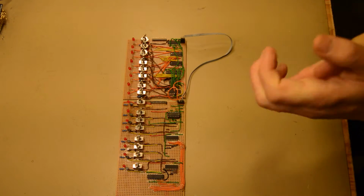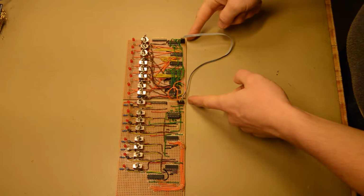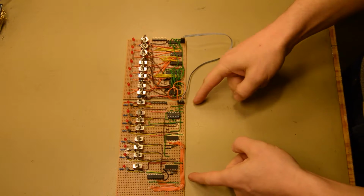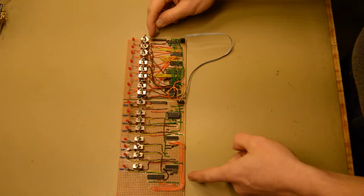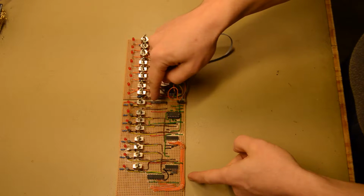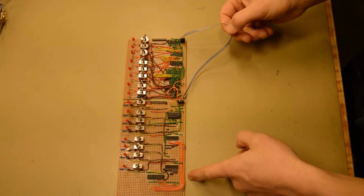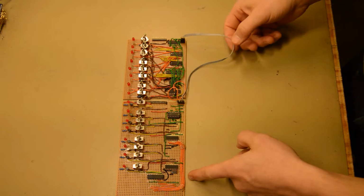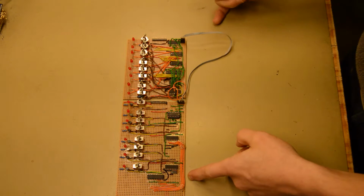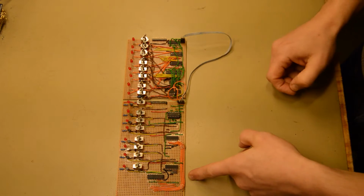So this is the 2 finished address boards. These are representing the lower 8 bits, and these are representing the higher 8 bits. The lower 8 bits plus VCC and ground comes in here, and the 8 most significant bits are coming in here. And this is propagating the loads, LSW and INC signals, and this is propagating the ripple signal going over.